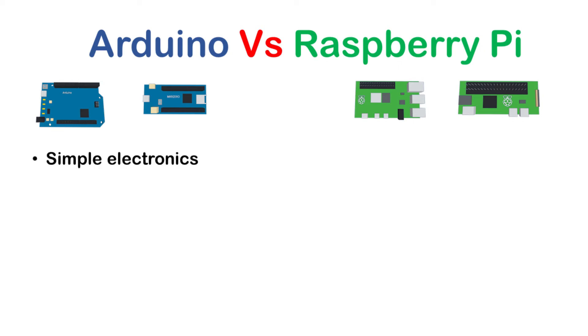Let's start with a simple electronics project — perhaps a temperature sensor that opens the windows in a greenhouse. The most important thing for this is for it to run reliably unattended, which is a good fit for the Arduino. As the program will be quite simple there's not much that can go wrong, whereas if it was on a Raspberry Pi you've got the full operating system running that you have to be aware of. On the other end of the scale, if you want to control your program using a mouse or a touch screen, then the Raspberry Pi is an obvious choice.